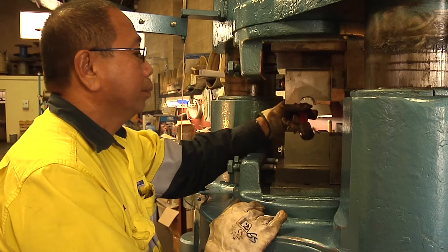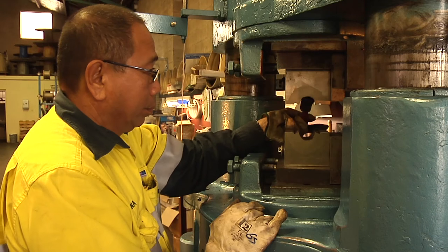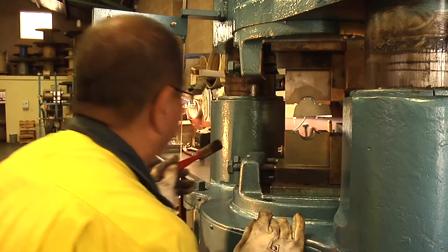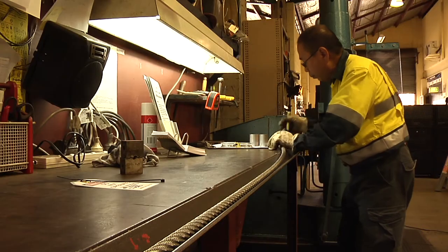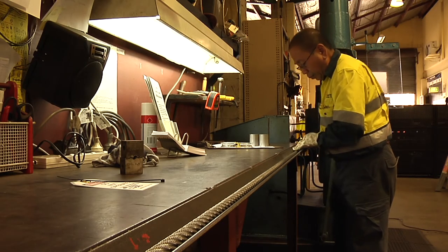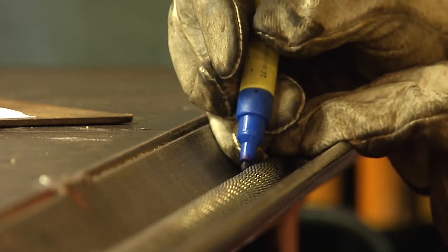The die's inner bore must be free of impurities and dust. Grease it with a suitable lubricant to minimise friction and stop ferrules from sticking to the die. Before you cut the wire rope to length, check your mark back measurements are accurate and have been clearly indicated with a permanent marker or similar marking pen.